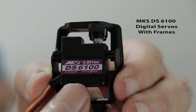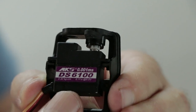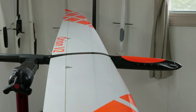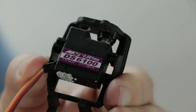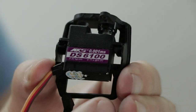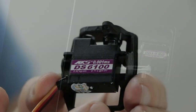For this airplane I requested the MKS DS6100 servos — these are really fantastic and I have them in all my airplanes. You might think a servo this small wouldn't be good enough for a big airplane, but these things are super torquey with fantastic centering, and even on the flaps they'll be absolutely fine. We're going to run these on rudder, elevator, flaps, and ailerons. I'd also definitely recommend the plastic support servo frames, which have a ball bearing supporting the output gear and axle — that makes servos run more precisely, last longer, and eliminates a lot of the abuse they can take especially on the flaps.